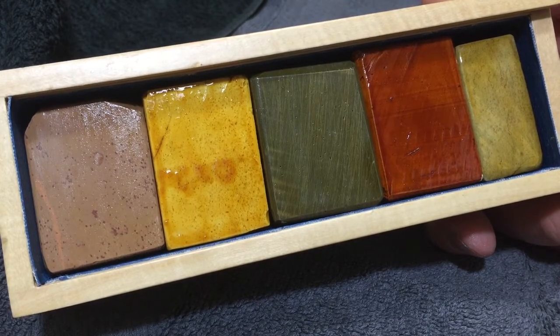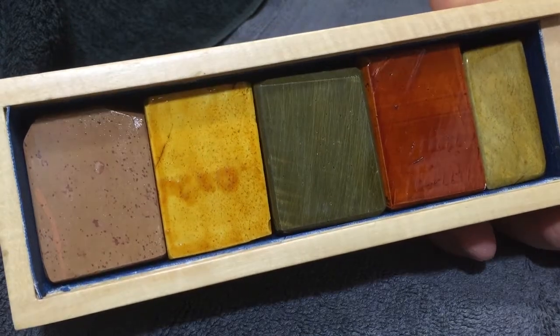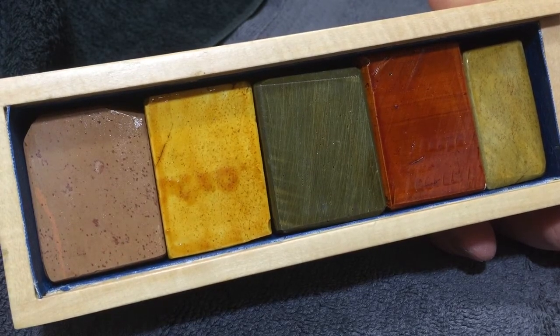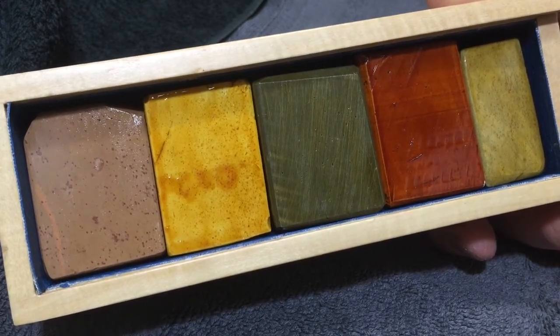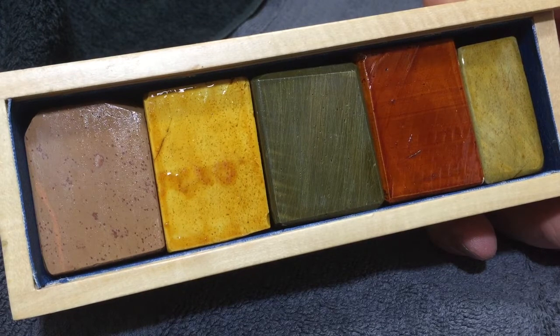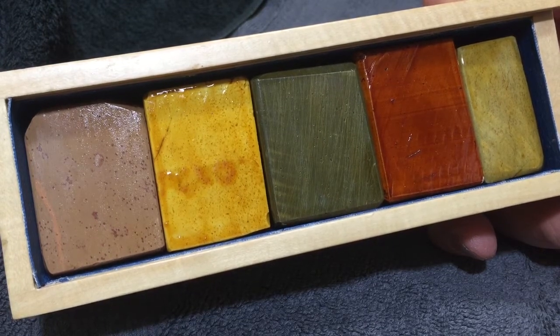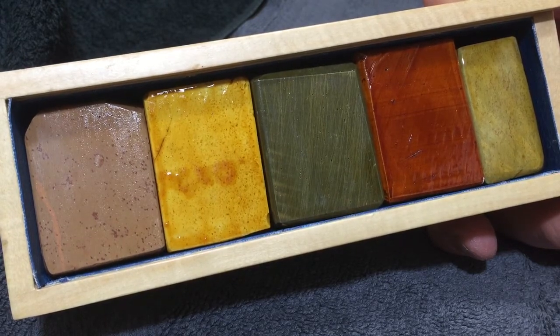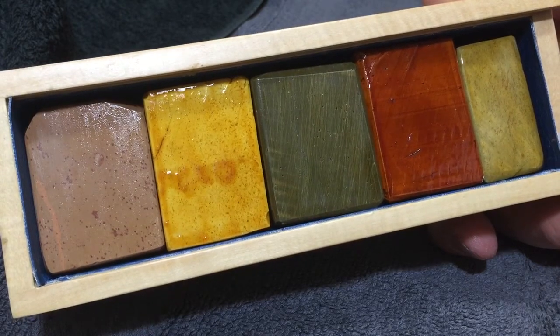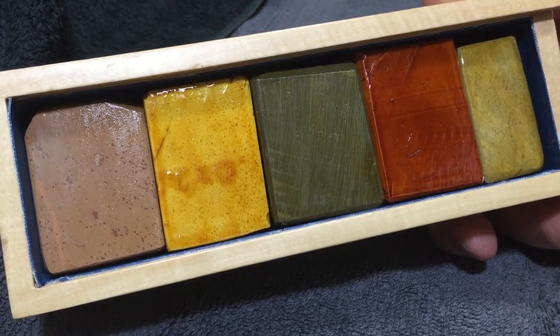Igarashi seem to be fairly clean most of the time, but a lot of them are really junked up with bad deposits. Same with Amakusa, especially those red ones, they're terrible. Omura hasn't been quarried in a long time. It's like a sandstone, so you have to be really careful there too. You need a really high grade Omura if you're going to hone a straight razor. Kitchen knives, big honking blades, that's another story. But for our purposes, our blades are very fine and need a lot of finesse.